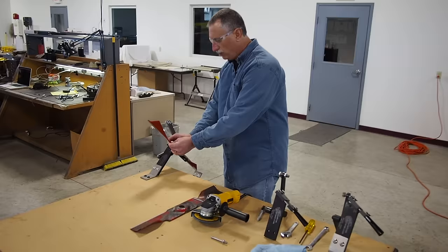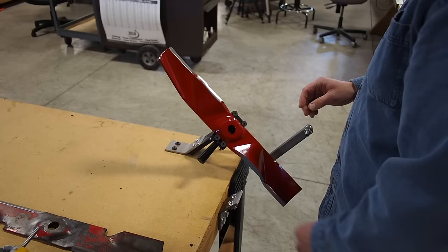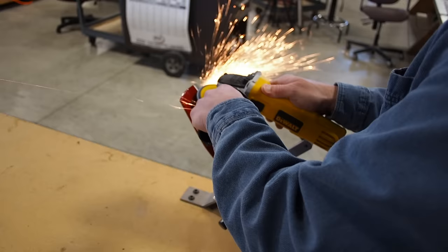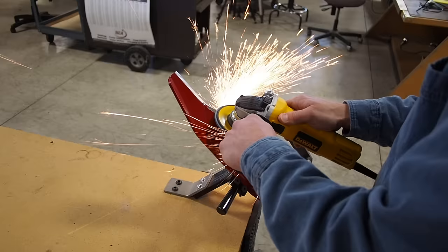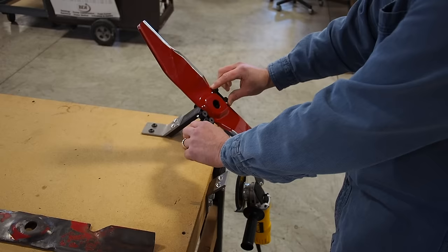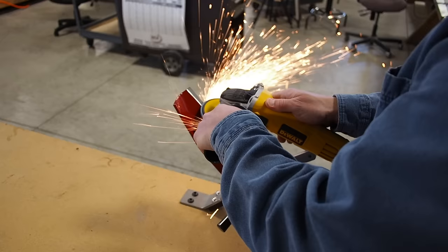Glasses on, mount my blade. When I mount my blades I like to make sure that I'm in the same place every time so that I know I'm getting the exact same grind every time I go back to it. So the outside edge — head down, guide arms back towards me. When I flip my blade over, I like to just leave the grinder hanging because it's faster. Flip it over, make sure I'm in roughly the same position I was before. Put the head in the down position, arms back towards me.